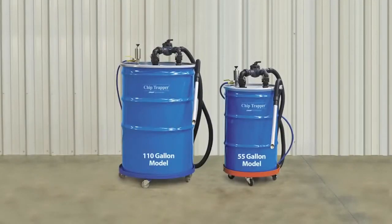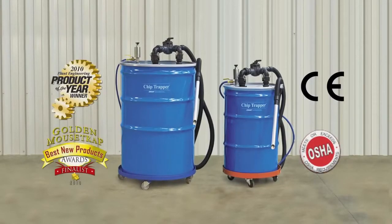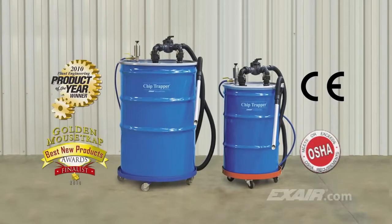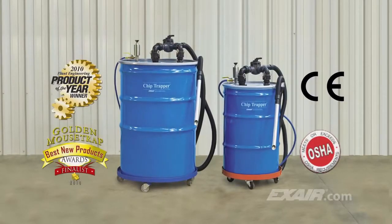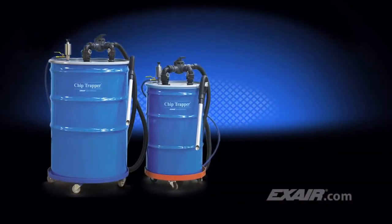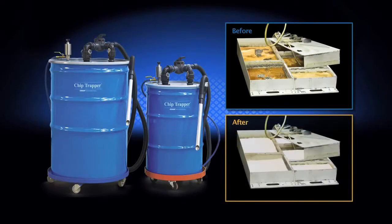Regular cleaning of your sumps with EXAIR's Chip Trapper gets rid of these problems, along with the added benefits of extending the coolant life and getting rid of the smelly mess. It offers a fast, easy way to remove solids such as chips, swarf, and shavings from used coolants and other liquids. The Chip Trapper vacuums up the contaminated liquids full of solids and debris, and then, with the simple turn of a handle and a knob, the only thing that pumps out is cleaned liquid.